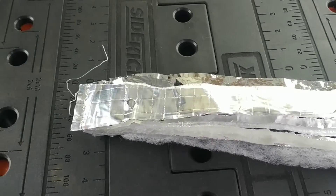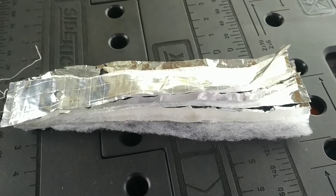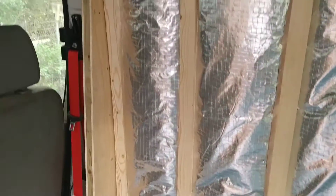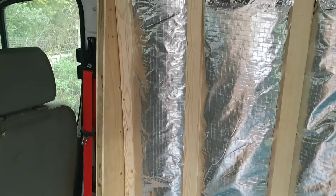It's a bit of a pain to work with. To put a screw in it, I found it's best to melt a hole all the way through, otherwise the wadding just goes around the screw head. It's designed to be nailed between battens — the normal way would be to put 25mm battens on the wall, staple it on, and then overlay with 25mm battens.